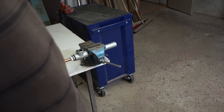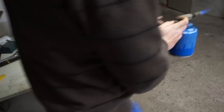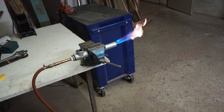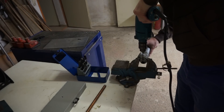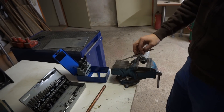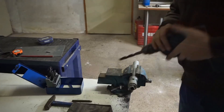The last thing to do before the first test is to mount this assembly in the burner shroud. Having hooked up a bottle of propane we can fire it up for the first time. I'd say that looks alright for the first test — it could do with a little more air though. It also turned out that the position of the gas pipe inside the burner shroud is important for a proper flame, so I added a screw on the end cap for adjustment as well as a few additional vent holes.